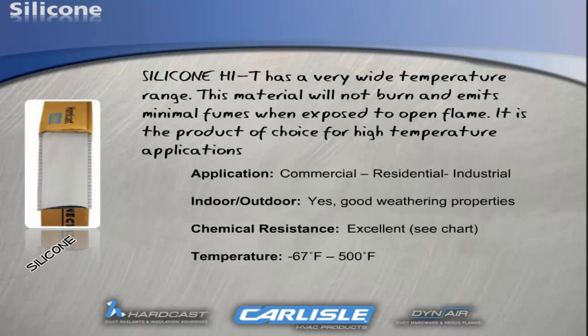Silicone connector has a very wide temperature range. This material will not burn and emits minimal fumes when exposed to open flame. It's the product of choice for high temperature applications. The applications include commercial, residential, and industrial applications. The product can be used indoors and outdoors as silicone has good weathering properties. Chemical resistance is excellent and the temperature range is between -67 to 500 degrees F.